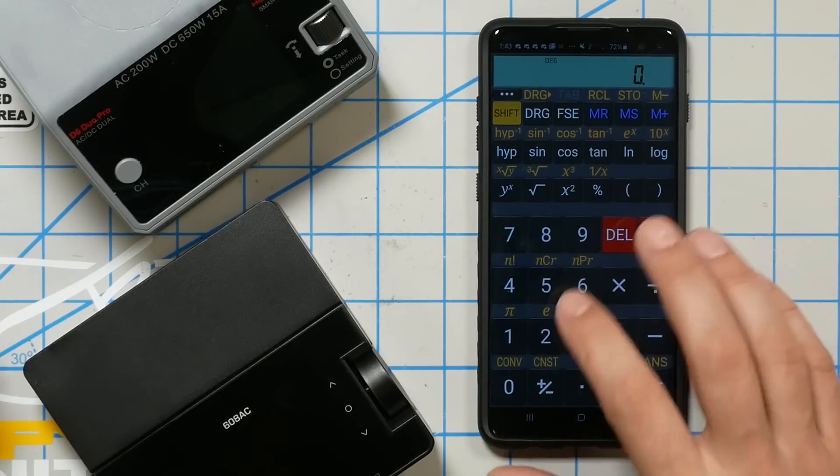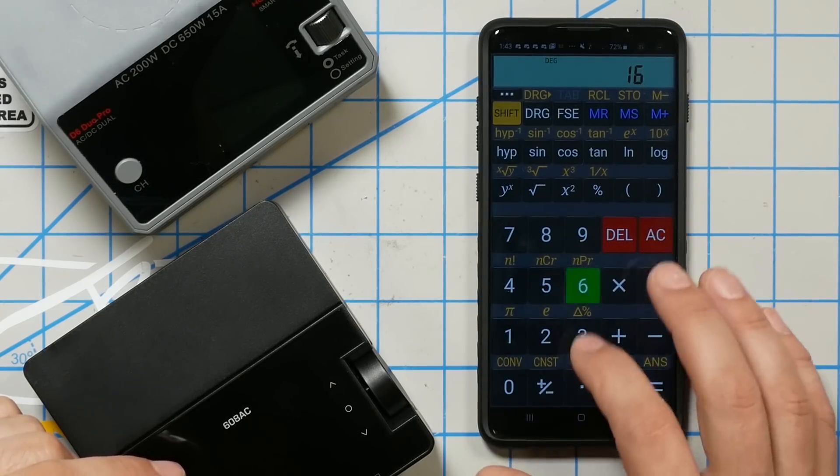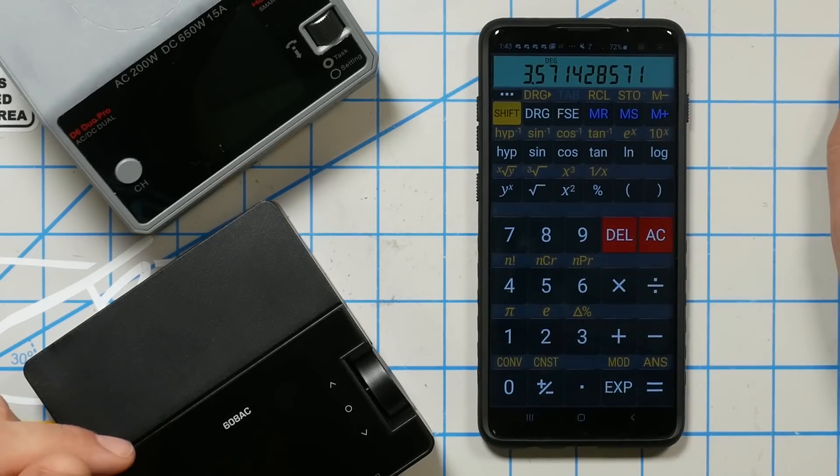You get everything you need in one package — the included AC-DC power supply, it's ready to go. But if you want it to be portable, the power supply just splits off, and it's basically the best of both worlds. Before you can know which of these chargers is really the right one for you, we've got to do a little bit of math and figure out how the specs stack up. The more power a charger can output, the faster it can charge your batteries. But charging batteries faster isn't always better, because if you charge them too fast, they can light on fire. The 608AC is capable of outputting 60 watts when running on AC power. We need to divide that by the voltage of the battery we're charging, and that'll tell us how many amps — watts divided by volts equals amps. If you're charging a 4S battery, a fully charged 4S is 16.8 volts.